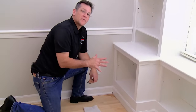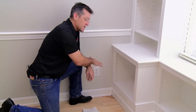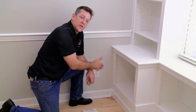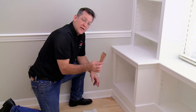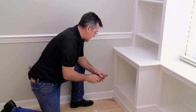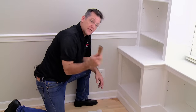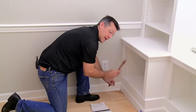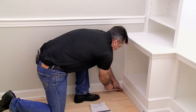All right, so we've got the floor sanded. Now we've got to deal with these corners. The edger, well, it has a rounded end on it, so you can't get all the way up into the corners. You're gonna leave a little bit of a space. You're gonna take a common paint scraper or hand scraper, and we're gonna actually use this to take care of these corners. You're gonna lay it up in the corner and go with the grain of the wood, and simply pull toward yourself.